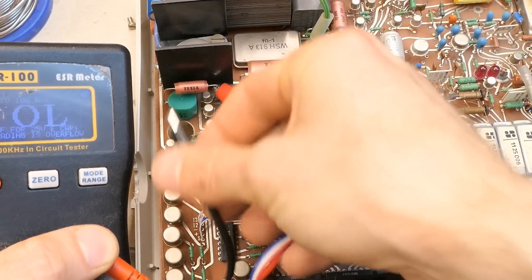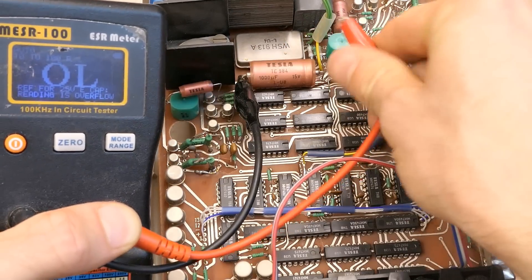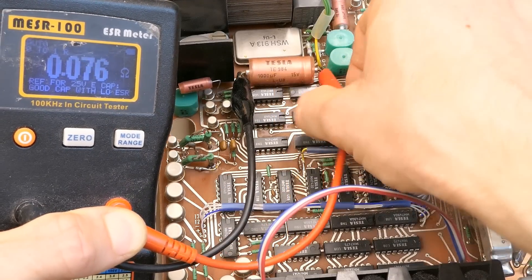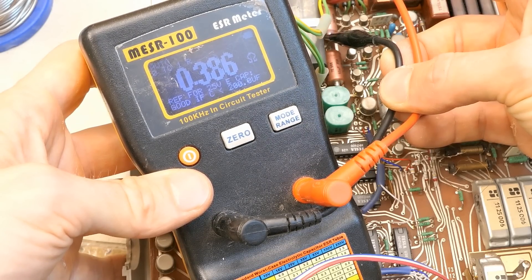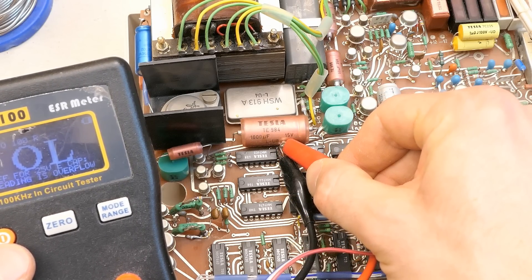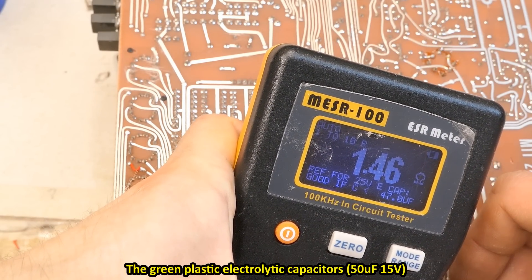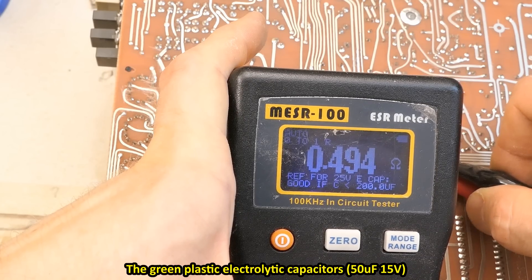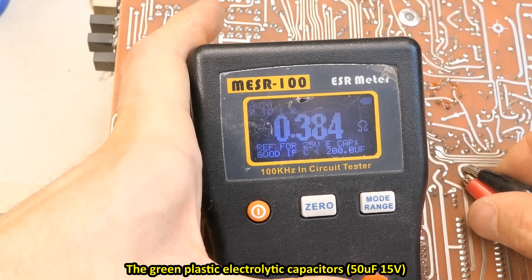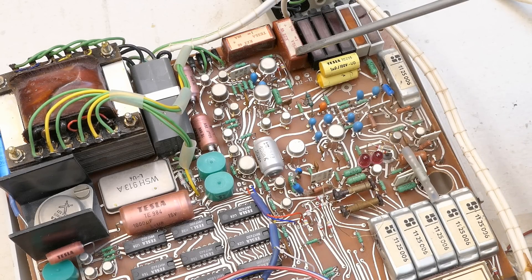Let's check the ESR of the electrolytic capacitors. Half an ohm — fine for a tiny capacitor. The big one: 50 milliohms, nice. 400 milliohms — acceptable for a small one. This one is the same: 50 micro, 35 volts. The big 1000 micro one has the lowest ESR of course. The botched-in one: 0.2 ohms — good. This one is 1.4 ohms, still kind of acceptable for a small capacitor around 50 micro. The last one even better. Surprisingly all the green ones are still good. This one has a bit higher ESR, maybe because it's next to the hot heat sink. And these things are zeners or series combinations of diodes for thermal compensation.